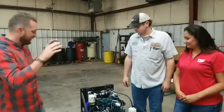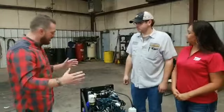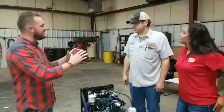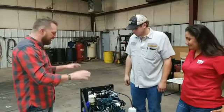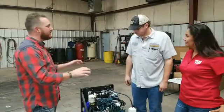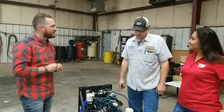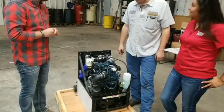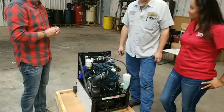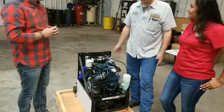So Taylor, let's break this down. I know that there's a lot of options out there when it comes to truckers with APUs. You guys definitely are Dynasis. You're a certified dealer with Dynasis. So talk a little bit more about this new unit, because they just came out with the new engine. Yeah, this is the new, they call it the Gen 2 K for Kubota. The 2-cylinder Kubota engine, 4,500 watt gen head, 55 amp alternator, 12,000 BTU heat exchanger.